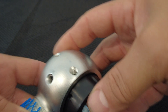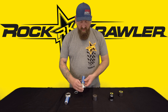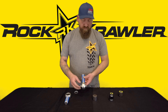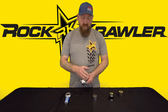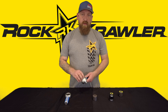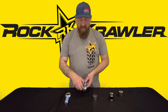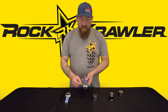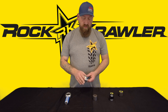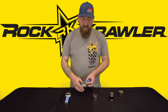It helps to have a small arbor press, but once everything is lined up it goes in nicely. Once the bushing is pressed in far enough, double check that you can see through the zerk hole into the ball right through the bushing. Then grab your other retainer and start screwing it in. For large crawler joints — anything with a one-inch, inch-and-a-quarter, or inch-and-three-eighths shank — tighten the retainers to 30 foot-pounds. Once one side hits 30 foot-pounds, flip it over, tighten the other, then advance until the next available mill flat engages with the set screw. On the ProX crawler retainers you can see the mill flat very easily — make sure they line up. For smaller crawler joints — three-quarter inch or seven-eighths shank — the torque spec is 25 foot-pounds. Same process: do one side, do the other, advance the retainer until the mill flat engages, and they're ready to run.